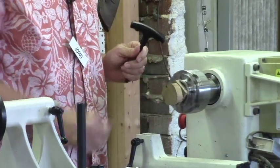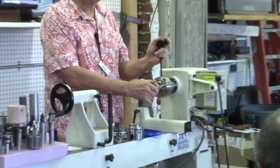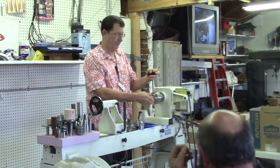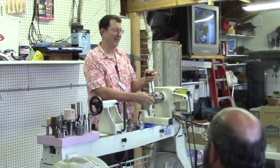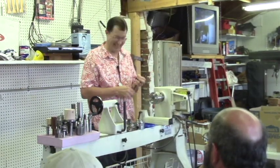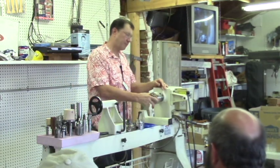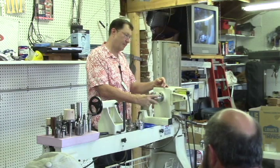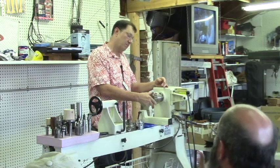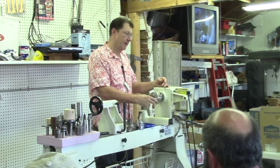That'll turn down. You were saying about turning it the wrong way, and if you buy the easy chucks, they have what's called a zoom ring on the back. Oh. And you just rotate that by hand. And that gets it. One, two, I can see four chucks in my future. Okay. Yeah, that'd be cool. They claim you don't have to worry about the... Oh, using the key. No, the number. Oh. They're all the same. Well, they make them to such tight standards that it stays concentric and you never need to do that.